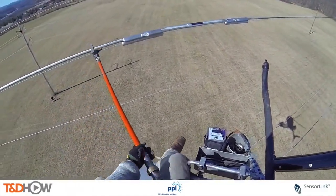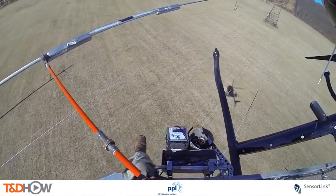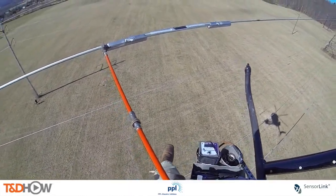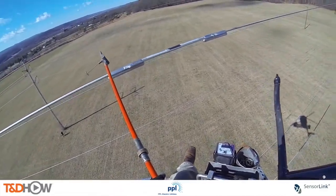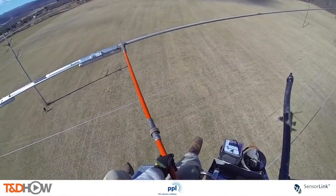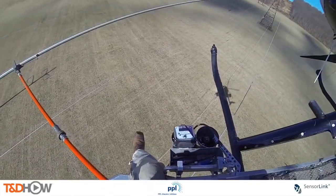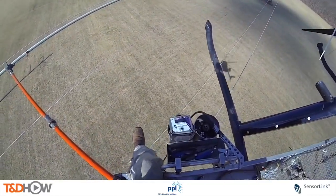Now there is one final task on this job. This is a couple of days later — the sun is out and the snow is gone. We are now taking resistance readings of the repaired splice. The resistance on the left side of the Clamp Star is 8 micro ohms, and on the right side it is 7 micro ohms. The bare line itself reads 12 micro ohms, meaning that the resistance of the repaired connection is less than the resistance of the line itself, and the line is now in like-new condition.